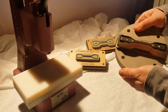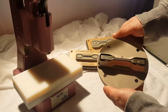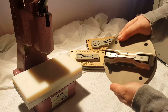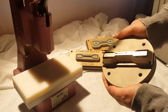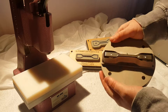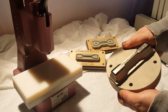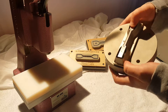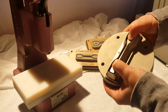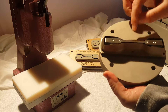Here we have our full hardened steel cutting die. This is a more robust die, designed to be used on larger presses and to cut harder plastics up to about five millimeters or so. Any thicker than that, you'll most likely have to machine the samples yourself in a CNC machine or similar. You can see here that there are some embedded springs — as this pushes down on the sample, the springs retract and the cutting edge is exposed.